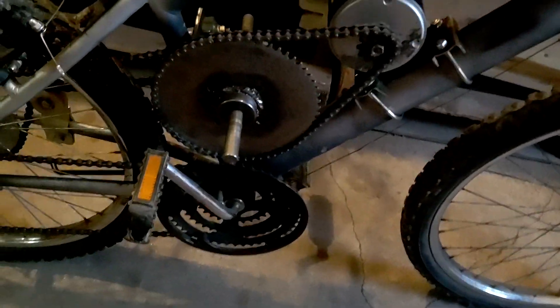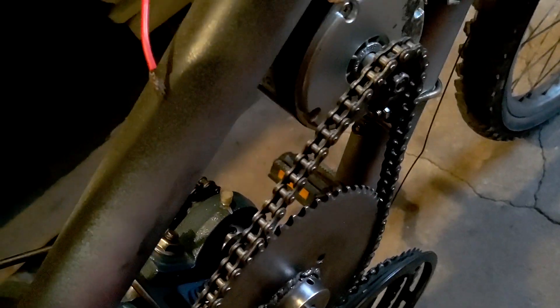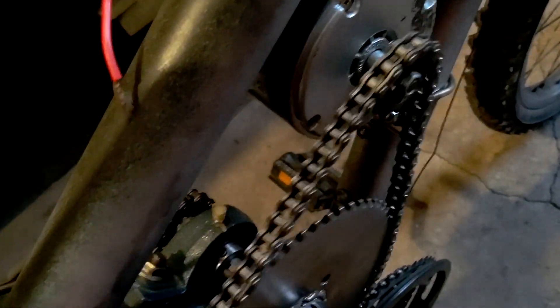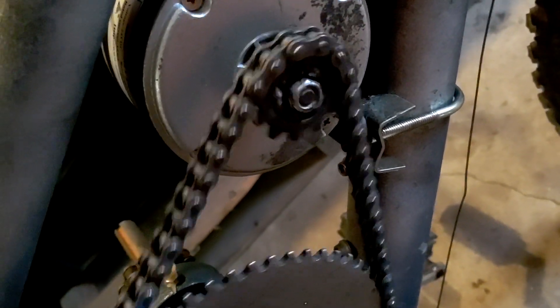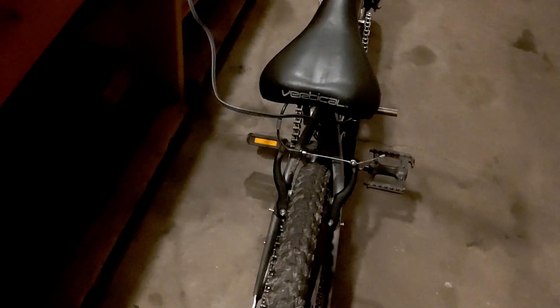The chain is shortened, motor moved forward, everything's tensioned. When I move it we're still kind of sticking partway — I'm not sure if that's resistance inside the motor from the electric coils or because my front sprocket was welded out of alignment. At this point we're just going to hook up a 12 volt battery and see if it throws the chain. It is a 24 volt motor but it will run on 12 volts fine for a test. I don't have the keyways in, so it shouldn't take off — I'll just tap it quick and straddle the back wheel just in case.